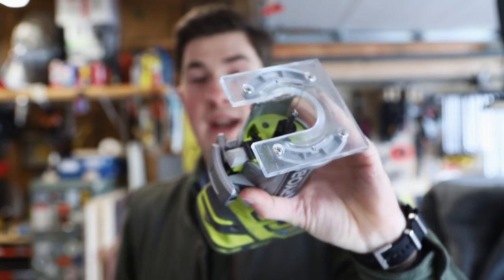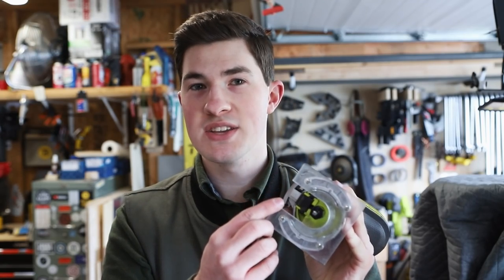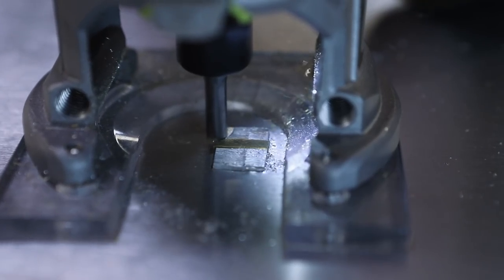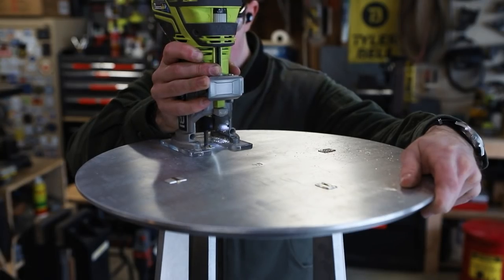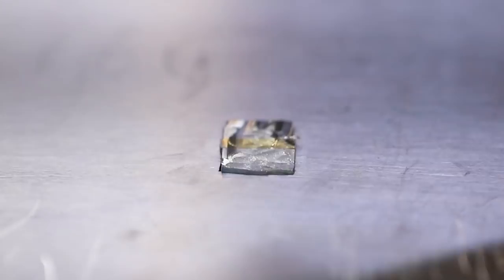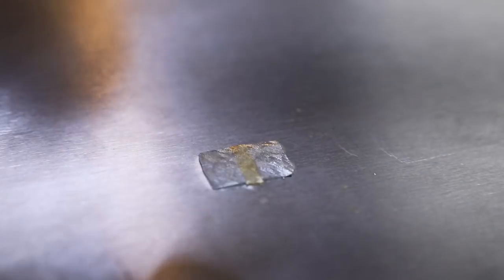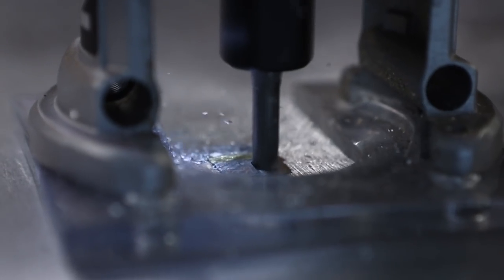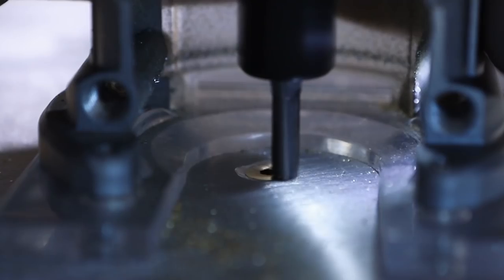I've got this router and I cut the base plate open on one side so that I could use an end mill and trim the tops of these tenons flush. I used to build airplanes for work and we used the same technique with a different tool to shave the tops of rivet heads flush with the skin of the aircraft. I cut the tenons so they were still proud a bit and I could peen them over to close up any gaps. After that I shaved them pretty much flush and sanded them.